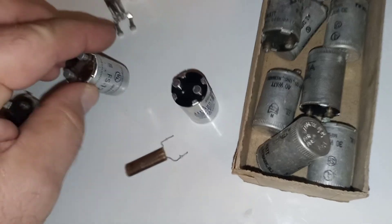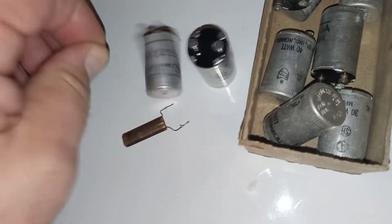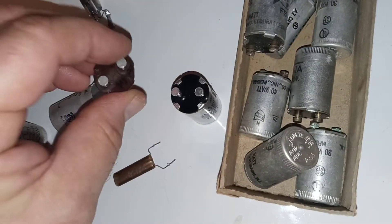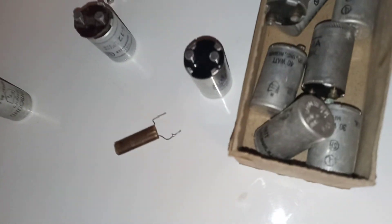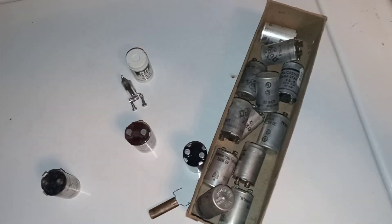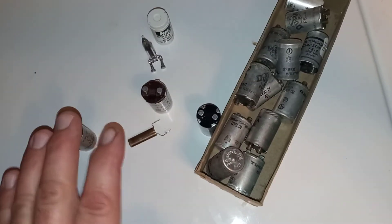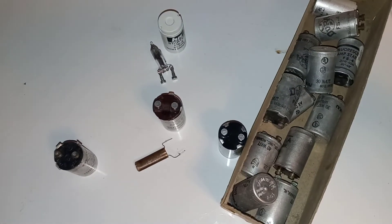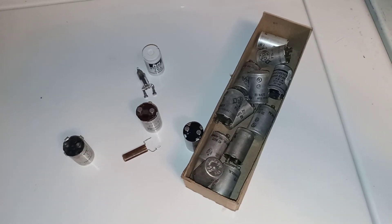Not all of them have it. This brand new one — I opened it up and showed you already — no condenser, just the glow switch. So nothing really to it. I just wanted to touch base on that because I don't think I mentioned it in the original video: you don't have to have the condenser. It's just there for noise suppression — it's a capacitor, it's a filter, that's all it is. If anybody has any comments or questions, please feel free to leave them. Thanks for watching.